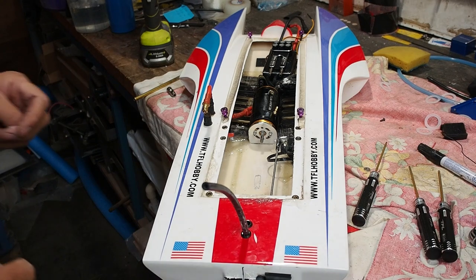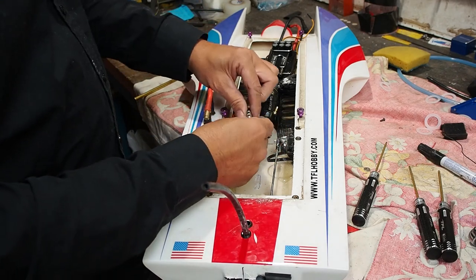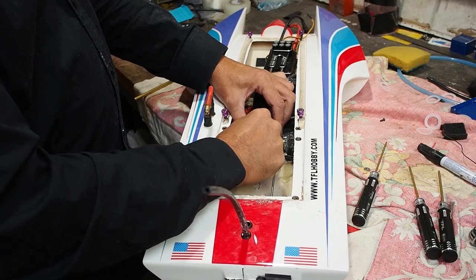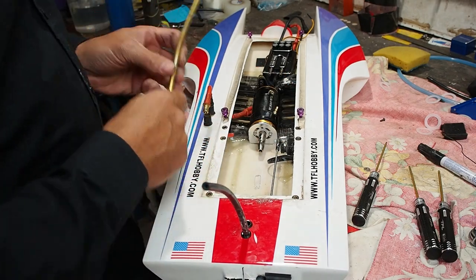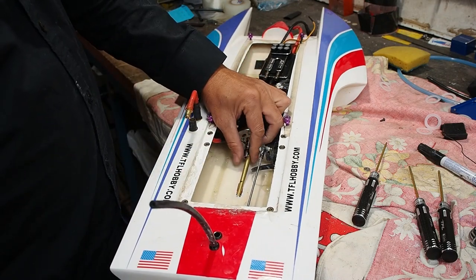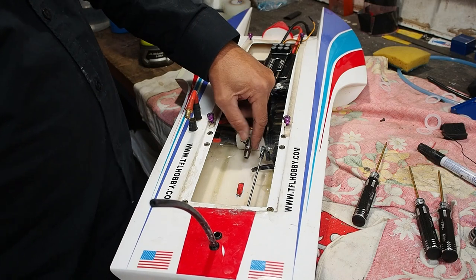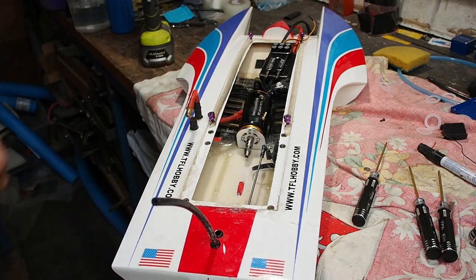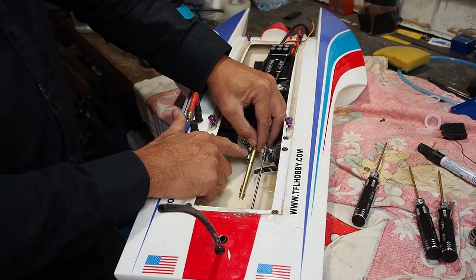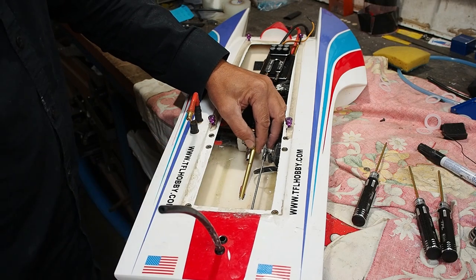I guess if you're not used to how much room you have to leave for a collet, just put a collet on there, rather than guessing like I do. I've probably done one or two more than most people who are watching this video. So that was my guess, and that's about right. Where that line is going to give me enough room to back the nut off the collet here. So that's where I'm going to cut it.